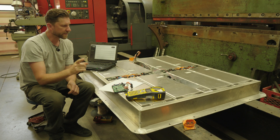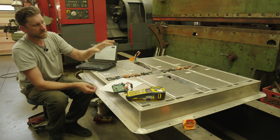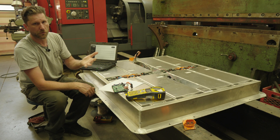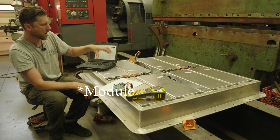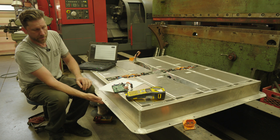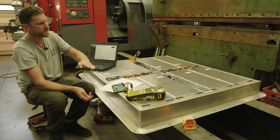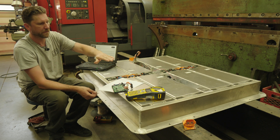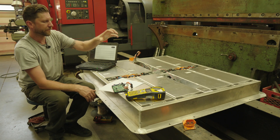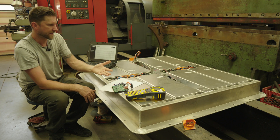The cooling is something I haven't discussed much. This battery is going to be cooled very similarly to the way Volkswagen does it — through conductive cooling through the bottom of each cell. The bottom cells are mounted to an aluminum plate, with about three-quarters of an inch before the bottom of the tray itself. This will have cooling loops run underneath the bottom of the battery, the exact same way that Volkswagen ran it, because the Volkswagen cells were originally cooled through the bottom.